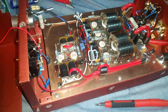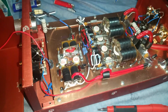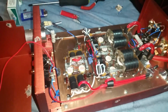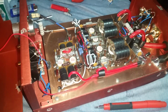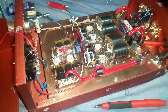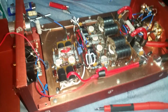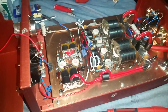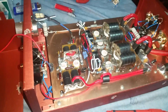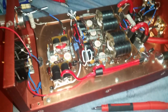And what seemed to have happened, I know that you're looking at a peak meter on your end. With the radio that you're using, which has even a little less drive than my bench radio here, you just weren't able to see that 1,000 watts that you were able to see before. So that's why you sent it back again. There wasn't anything wrong with what I did. You just needed a little bit stronger radio to get the same output out of it, because you watched the video and I was still able to get that KW out of it, no problem, with all that input padding in there.